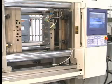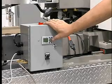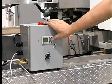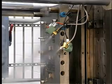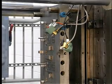The Slide Freedom Automatic Spray Unit is a simple plug-and-play automatic spray unit that works autonomously from your other molding controls. It's comprised of a control box, proximity sensor, and spray heads. The Freedom Automatic Spray Unit is designed to be used with Slide's bulk aerosol cylinders.